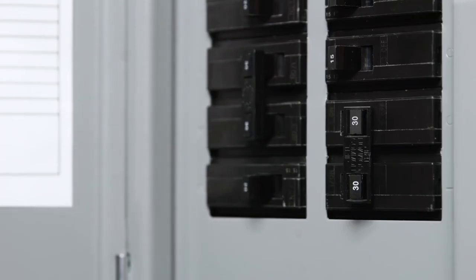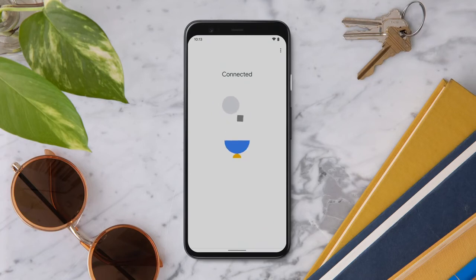Now go to the circuit breaker and turn the power back on. Next, select your language. Then the app will test the installation to make sure your thermostat is getting enough power. Now follow the remaining steps to tell your thermostat a few more things about your system. You'll select the mode you want to use when you turn your system on, and then you'll connect to Wi-Fi.